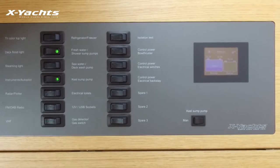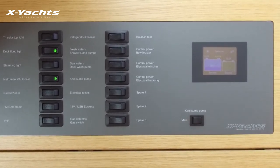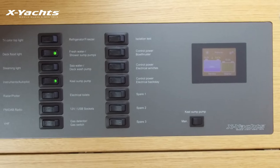When you come back to the boat, you should manually activate the electric pump to make sure your automatic switch is still working and that you have no water in the sump.